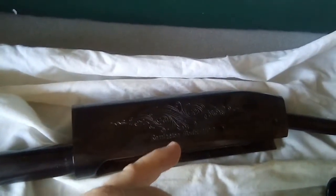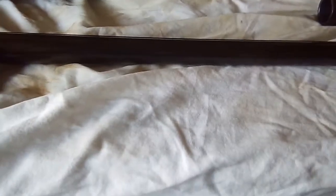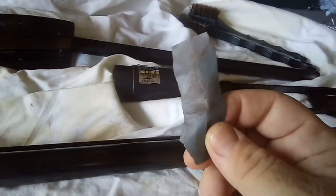I've literally done this barrel twice, completely twice, and started to go back a third time to try and blue it without having it rust. When you get into the rib vents, that's what caused me to do it a second time. I even had to come back a third time just to remove rust that still formed underneath - where my thumbnail touches, the bottom of that ridge rib vent, the top of the barrel, the whole side piece where the rib vent is welded to the barrel. I had to go through three of these just to do that entire underside and strip it back down to bare metal.